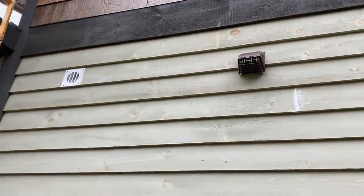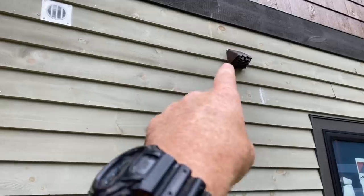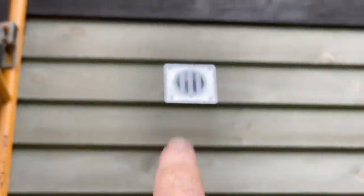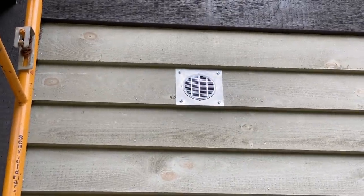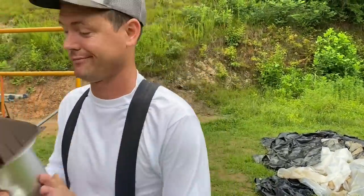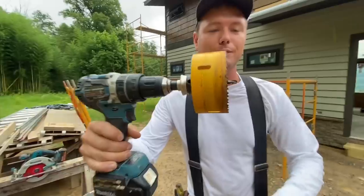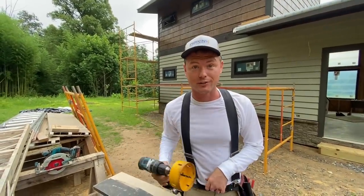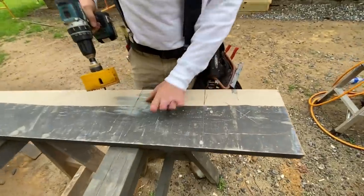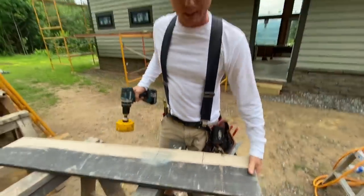We're painting this side of the house and we've got a situation — this vent comes out between two pieces of siding, which doesn't work or look good. We're going to cut a block that's flat for that vent to mount on. This type of vent is really meant for a soffit and may not be waterproof, so we picked up a better replacement and we're cutting a block for it. I've got my four-and-one-eighth inch hole saw chucked up with enough stick-out on the pilot bit. The smart move is to drill the holes before cutting the blocks off so you've got a large piece of material that's not going to run around on you.